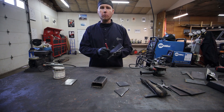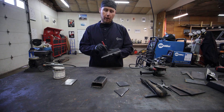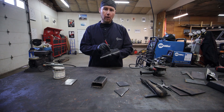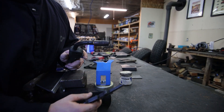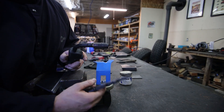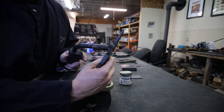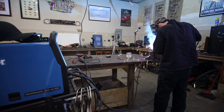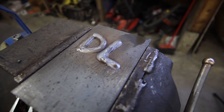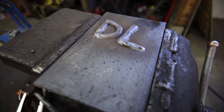We're not going to do any circles, any weave patterns, or anything fancy. We're literally just going to start at one point and do a really hot weld all the way across. Every time before I start welding, I trim the last little bit off the wire because it's contaminated — sometimes it's hard to start a new weld because there's dirt and stuff stuck in there. So we just trim that off and now we've got a fresh piece of wire to start with. This is what it's going to look like — basically just a couple of fat slugs. They're not pretty, but this is what you're looking for.